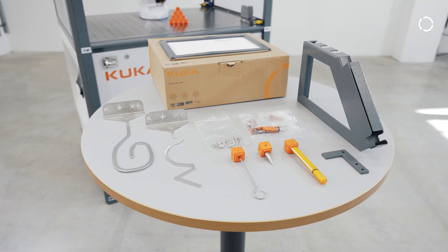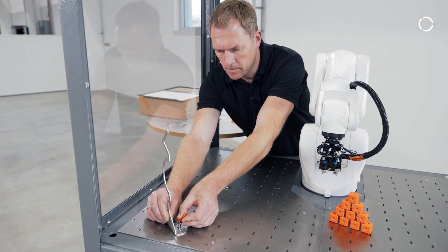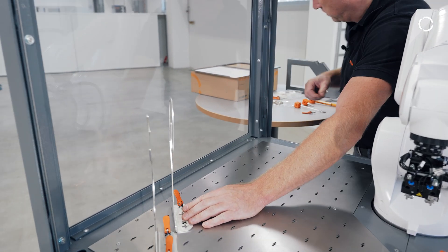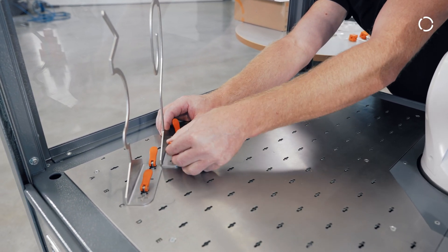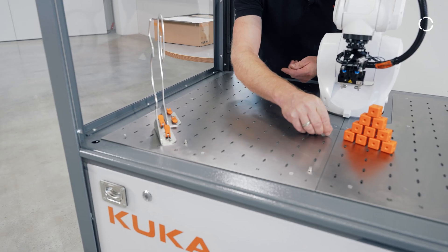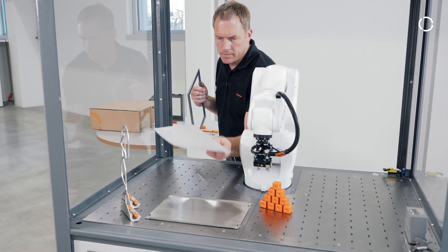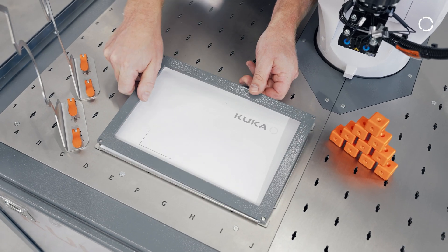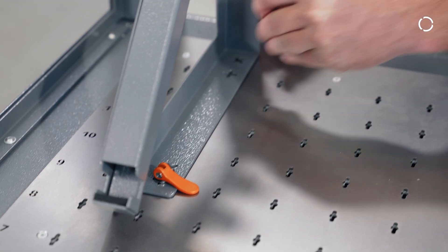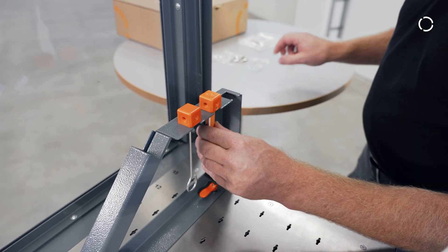The application package Pro comes in an extra box. Mounting it is pretty easy: we take the components out of the box and mount them on the application plate. The hot wire application and the magazine can be mounted with quick fasteners. The paper holder and the bracket can be fixed with 6 mm pins. If you want to use the KUKA demo programs, it is necessary to mount the components in the positions as described in the user manual. The tools and the cubes are stored in the magazine.